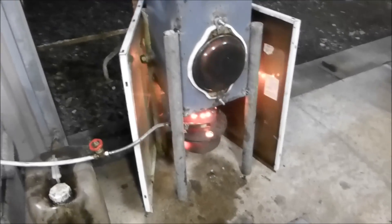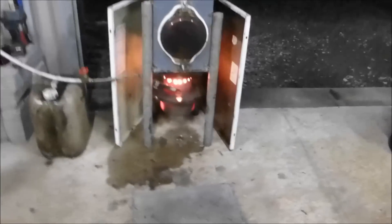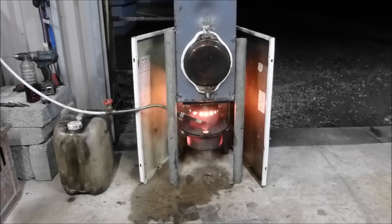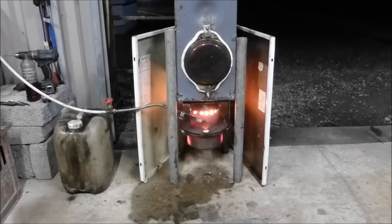I took the baffles out of this particular unit — and there they are. The reason I pulled the baffles out is because they were set up for a burner that has a blower on it, generating positive pressure within the stove. Whereas we've got a flue on it creating negative pressure, and it wasn't working that well. If I re-engineered the baffles and made the holes in them bigger, I could make the boiler more efficient. But this is just prototype one. There are other ways of generating heat within a boiler — Babington boiler, torque burner, whatever. There's a few — even modifying a domestic burner unit like a Bentone with a siphon nozzle. There are several ways of doing it. This is just what I could do today.